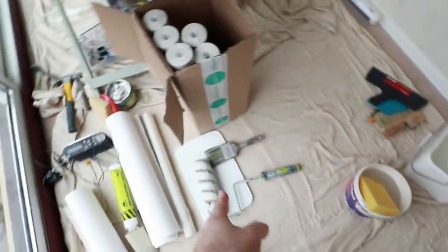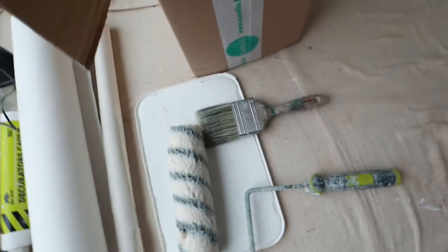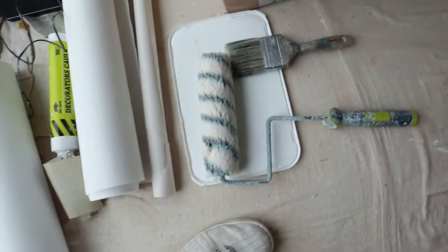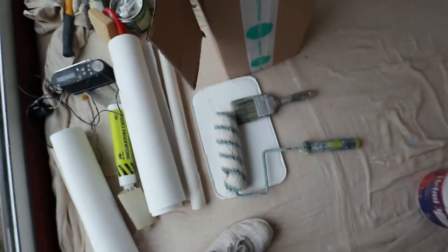Right, what I've done, I've come down these angles, done all the angles, used my laser liner, brought it in, full drops, dead easy, paste the walls, dead easy. I've got a 2.5 inch emulsion brush, that's the Eco Ease brush, and then I've got a medium pile roller. Cut in, roll, dead easy, can't go wrong with that.